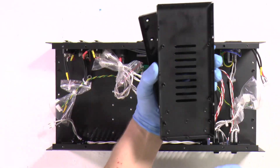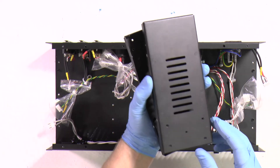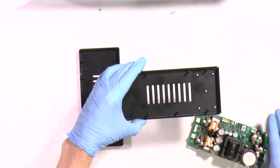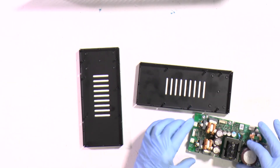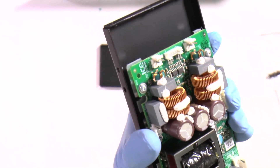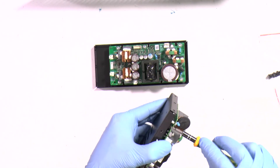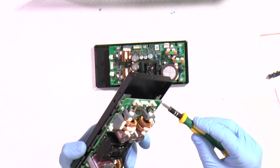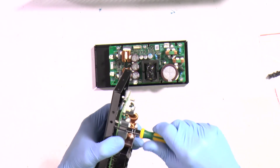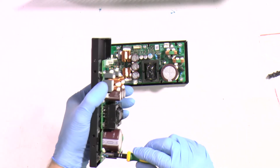Removing sides. For the sides there are standoffs for the Ice Power 200 A2. When assembling, you should locate those five screw holes to the front - orientation: the large capacitor should go toward the direction of those five holes. There are special cutouts in the heatsink to secure the board. Position the heatsink cutout to the standoff and secure.